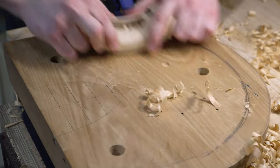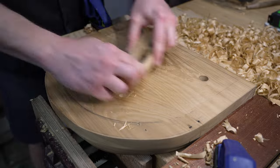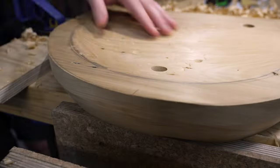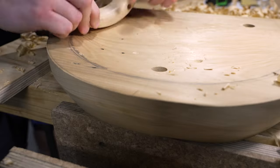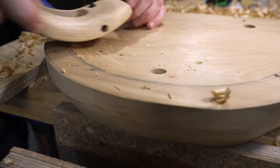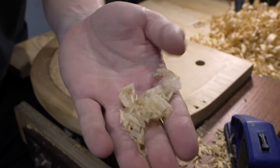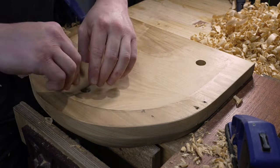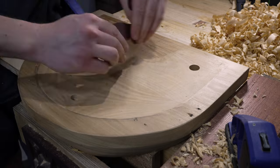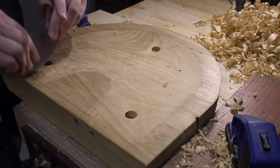I haven't really had much practice with carving seats, so it's just a bit of a learn by doing. You could use an adze or a scorp to do this as well. The travisher is a fantastic tool, but really it's the card scraper that stole the show — it's just so good at smoothing things out. Slowly getting there. I think the main thing here is you want your bum cheek grooves to be even left and right — that's the technical term. You also want to keep that perimeter line running around the back quite sharp. I feel like this helps frame the seat and really emphasises that groove you've made.